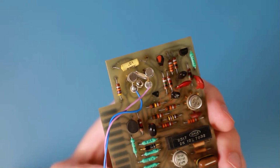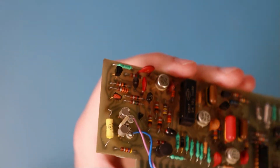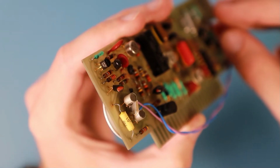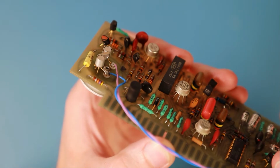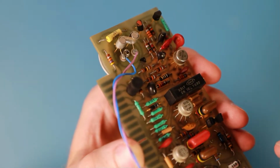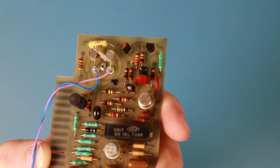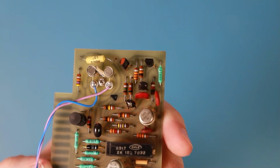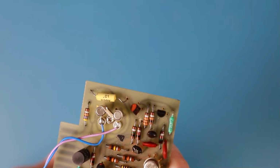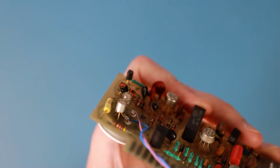And also these two transistors, they are somehow connected together. I think that's to thermally couple them. So I think this is some kind of special amplifier. I think the analog circuit designers could tell us more about this construction. But I'm really sure this is a specially optimized amplification circuit. Also, these transistors have 4 legs, not 3.